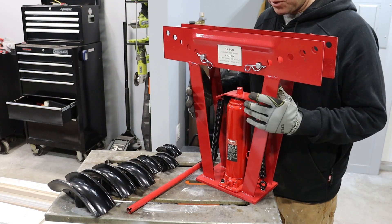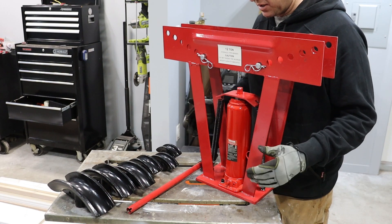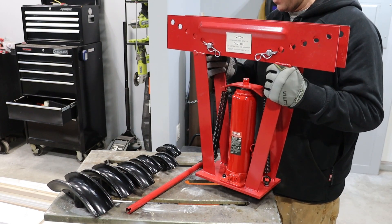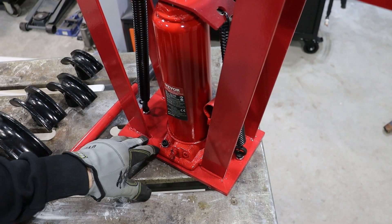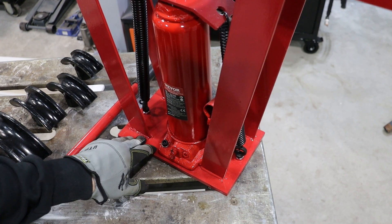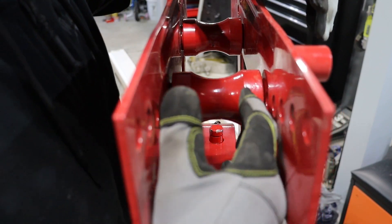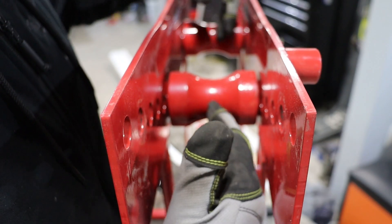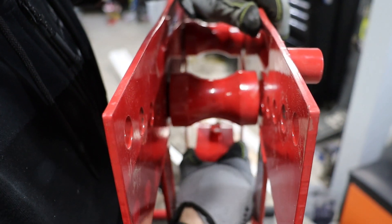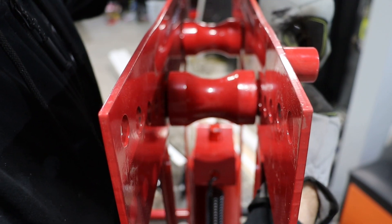With the dies and everything, it weighs about 70 pounds. This is a benchtop model, so I'm just going to be putting it up on my welding bench and not leaving it mounted — it's not too heavy to just pick up and move around. There aren't any holes in the base to mount it down to a table, so you might have to do that, but I don't think that's a huge deal. One thing I did notice is that this will spread apart pretty far, so when I was trying to keep my pipe at 90 degrees, I could tell it would shift a little bit under pressure from the jack. I'm probably just going to put some washers on the outsides to keep it tight — maybe it'll help, maybe it won't.